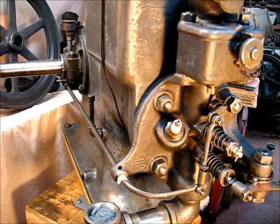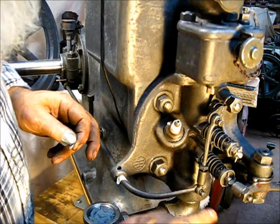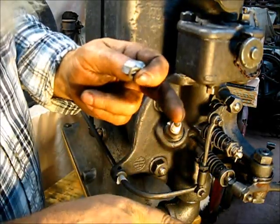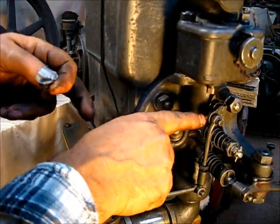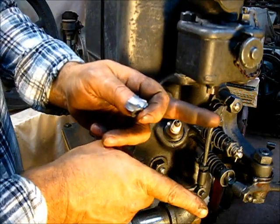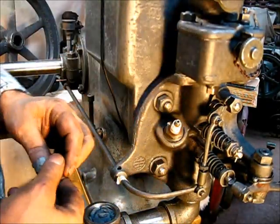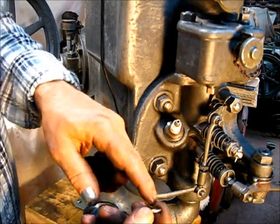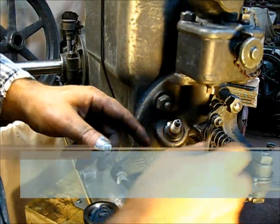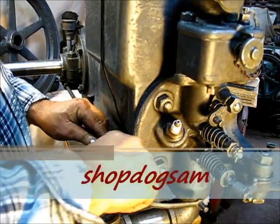It's important that this part here and the two pins that come out are parallel — plumb. The one up here: don't be fooling with that because that's pot metal and you will break it just looking at it. If you're going to do any bending, do it on the bottom one. If it's at an angle, bend it so they're both plumb. The spacer washer goes down there, the spacer washer goes up here, and then the cotter goes there and the cotter goes there. It's free-moving. That's the adjustment right here — and that explains it up to this point.